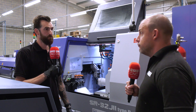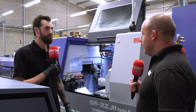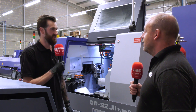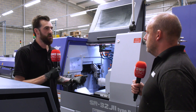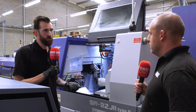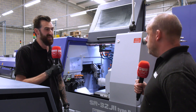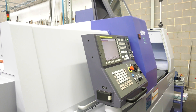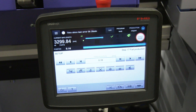I'm assuming you're going to be running unmanned — going home at night leaving these machines going. From experience you come in in the morning and you very rarely see problems. It depends on the job, the material, and the application, but when you've got the experience you generally know what you're going to get from a machine. We've got the swarf conveyor on this particular machine, which is going to help overnight running because quite often you have to stop due to swarf build-up. We've also got HFT to help chip it and high pressure coolant to improve tool life and clear the swarf.